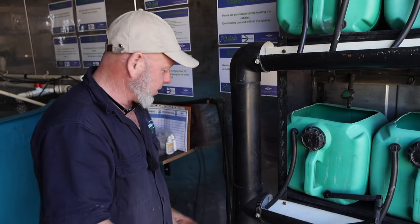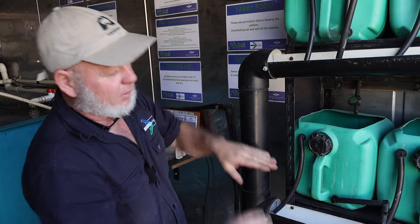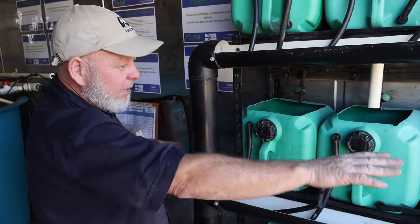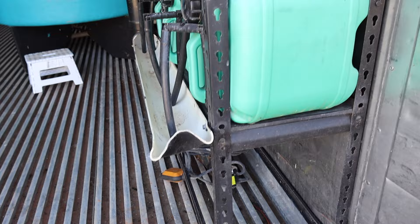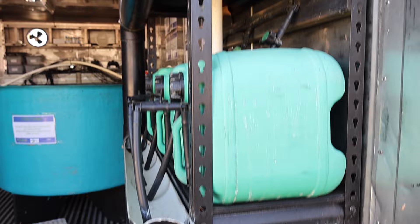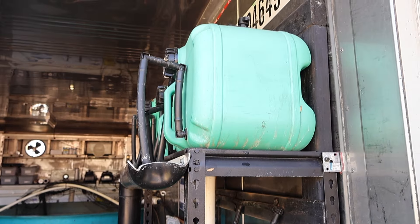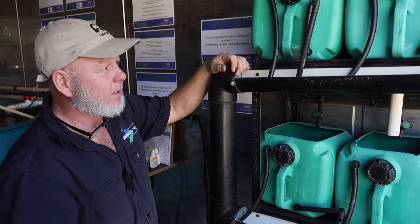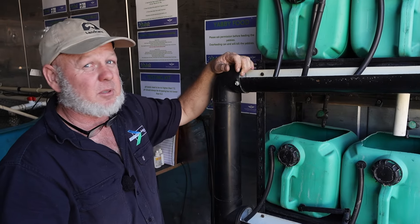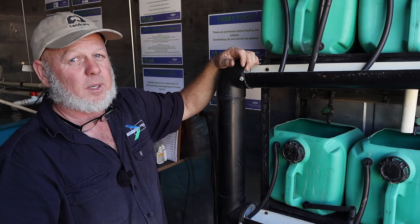And what pump drives this, mate? What size pump? I just use a little one — a 1,500-liter one — because you've got to consider the head height you've got to get to up there. If you're going to do it on just one level, a 1,000-liter pump is fine, and it just depends on how many of these units you've got. You could go up to a 16,000-liter pump, or you could go down as low as a 500-liter pump.